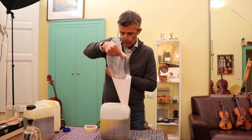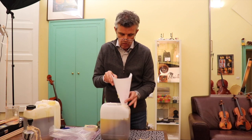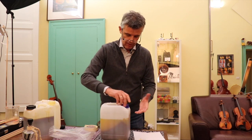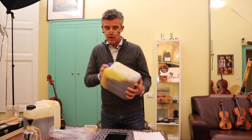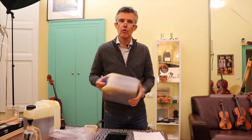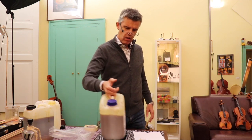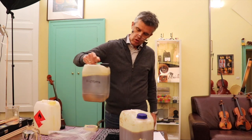Instead of cooking this whole thing, just leave it — that's what I usually do. Before shaking, close it. I should wear protection, but since I was a child I always do the most dangerous things without protection. Be sure it is closed, then shake. You can see the flakes of shellac inside. Don't leave it too long in the beginning or it gets clumpy and takes a long time. The pieces of Benzoe take a few days to fully dissolve, so just leave it and give it a shake every now and then.